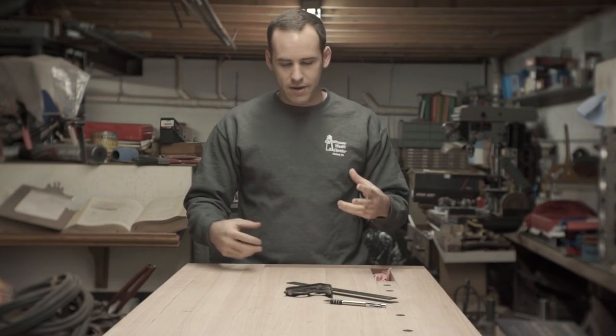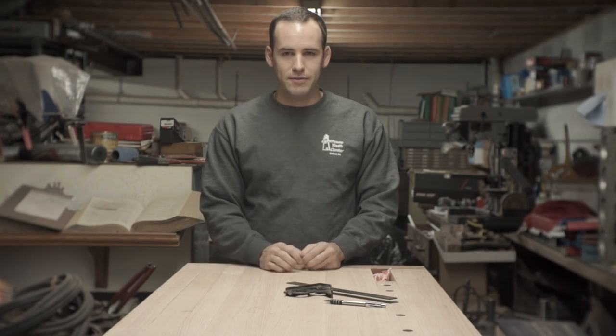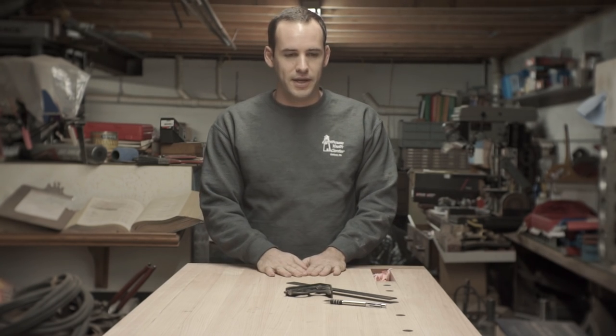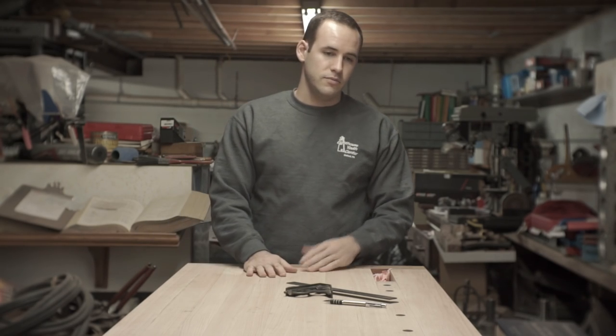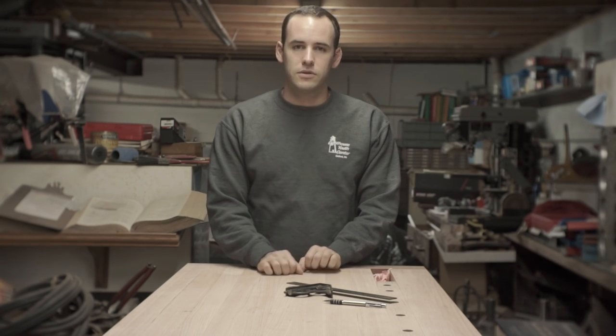Just haven't gotten around to it. Been thinking about how I wanted to do it more so than actually building it. And also it just takes a lot of time to build up the boards and lay it all out. Just thinking about the vise here took me a while, but I'm glad I'm at this point. I'm just about ready to do the legs, which I'm going to put in with some rising dovetails, do the leg vise, and then run some stretchers, and hopefully do some cool joinery with those as well.